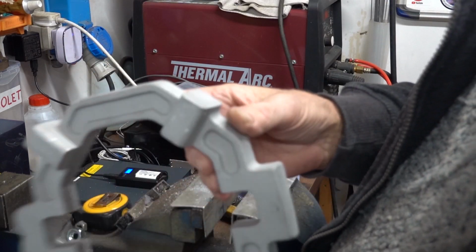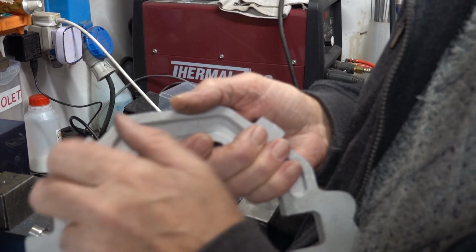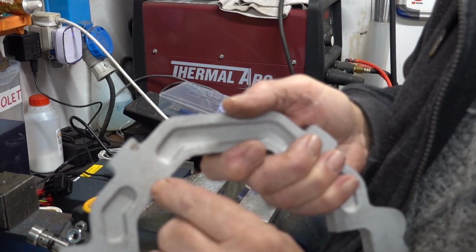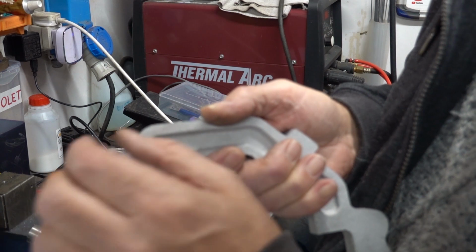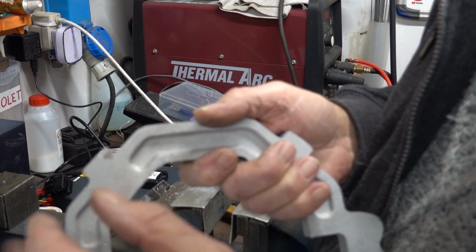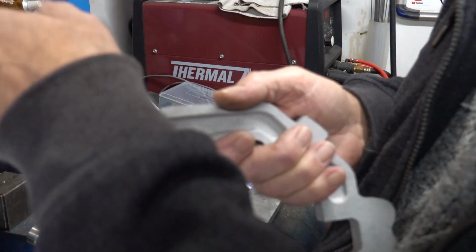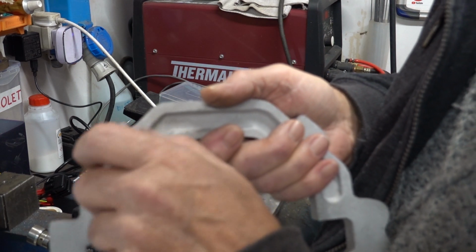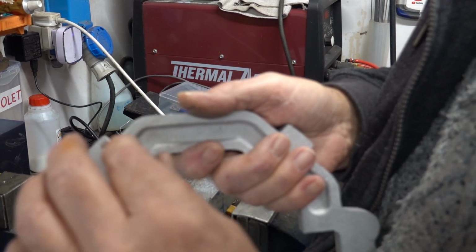And then a locking mechanism, which is quite unique actually. In the middle it'll have an M6 with a locking screw and a washer, and then here and here will be drilled and reamed clear through to the centre bar, and 2 dowel pins go in that are a slack fit, a quarter or M6, 6mm, sorry, dowel pins that will slide in and out of there, and they're what press on the finger to stop it sliding down any further, and that's got a flat on it. And then this M6 thread in the middle and thumb screw is to press down. It's an inch in diameter with a washer on it, and it presses down on the 2 dowel pins, which push them in and lock them onto the main shaft, which is quite a nice idea.